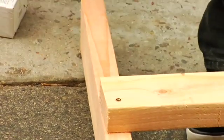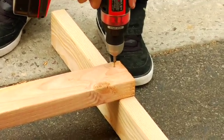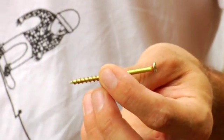The screws that we got, 2.25 inch screws. These are just about perfect for the 2x4s. You can go a little bit longer, but anything longer and it will end up poking through. So the next step will be creating the hinges. That way it's foldable, easy to transport and whatnot.